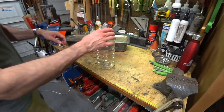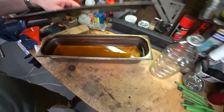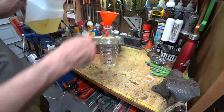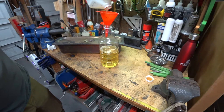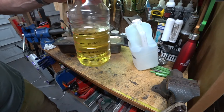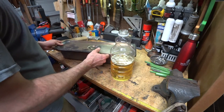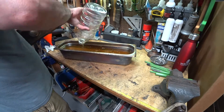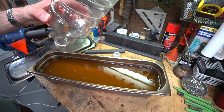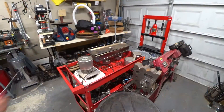I made about three liters of biodiesel out of some vegetable oil that I had on hand, and this initial sequence shows me mixing up the vegetable oil and the biodiesel. I experimented with 75% biodiesel and 25% vegetable oil, and then also the opposite — 25% biodiesel and 75% vegetable oil — and then I compared that to 100% vegetable oil and plain water. I decided to experiment with biodiesel because it's a lot lower viscosity than pure vegetable oil and the two mixed together well.